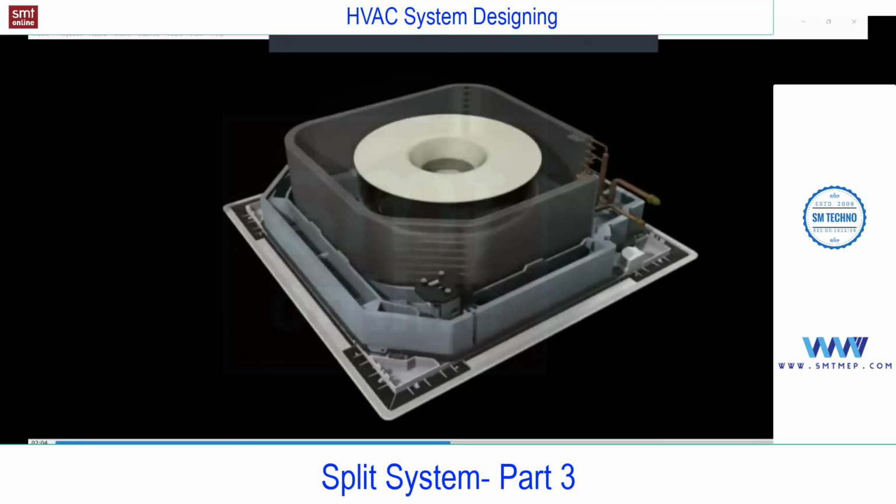So through wall chipping, we can take the drain pipe below the level of that unit so that we can maintain gravity to throw the drain water out through this U-trap. But in this case, I cannot take the pipe below the level of this unit because this is ceiling suspended. So remember, in a cassette FCU, you'll find a drain pump. As the water starts collecting in the drain tray and the level increases after some time, a drain pump will suck the water and throw it into the drain pipe, so that the drain pipe can connect above the level of this unit.